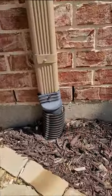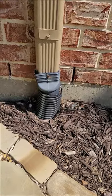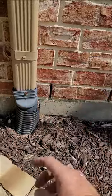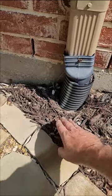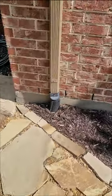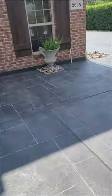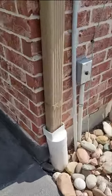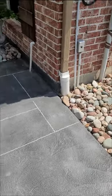The one thing about this setup that we don't love: I've never liked this black corrugated pipe very much, especially for this application. A weed eater has to come along it, and in a grassed area, when a string trimmer hits this it'll start wearing on it and over time will absolutely just cut through it — then you're back to square one or have to do a repair. Something we like better is using sewer and drain pipe, white rigid pipe with the right fitting. This works great; it's what we've done for years.